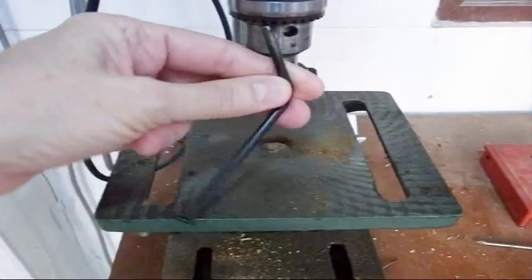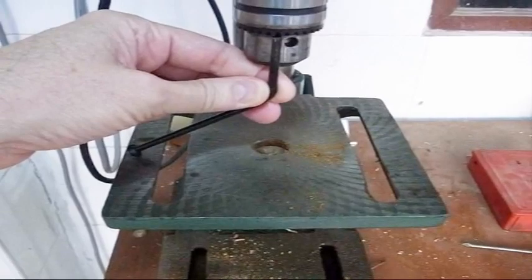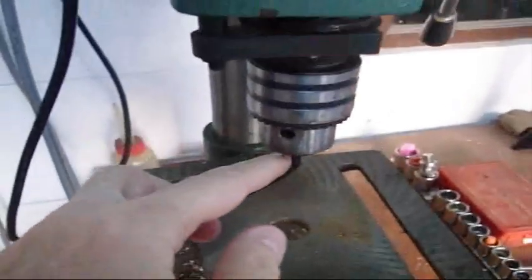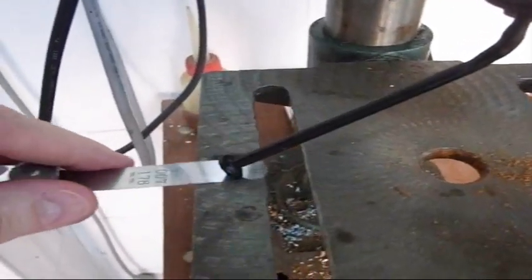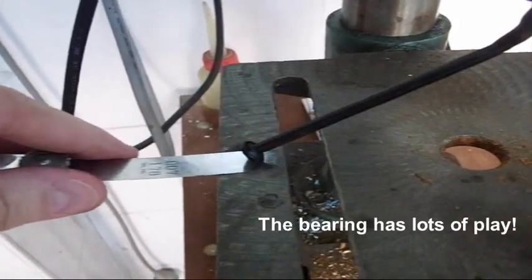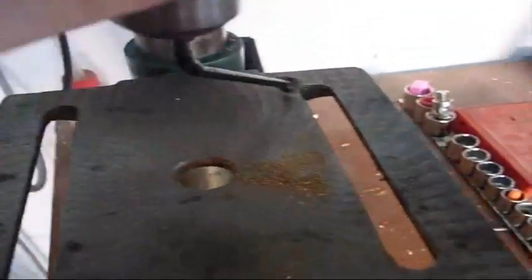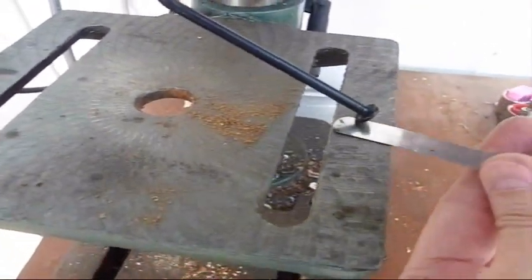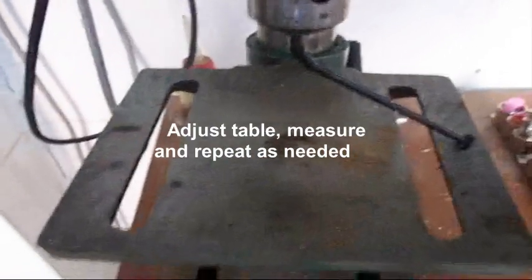When it's chucked in there, it's touching the table all the way around. With your drill press unplugged — make sure it's unplugged — you put this wire in and fasten the chuck firmly. Then you simply measure using your feeler gauge the distance on one side, then on the other side. Make sure you get in there square. This table is not exactly square front to back; I've got about 0.178 millimeters on both sides. This is still very square from when I made the last video.